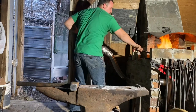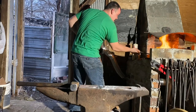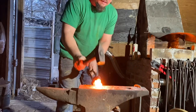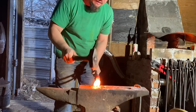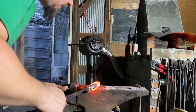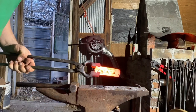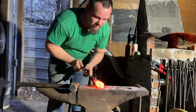We've got sparks — let that soak, then back off the air just a little bit. You'll notice I'm only hitting around the edges; we don't need to be collapsing that bore hole that we made. Okay, so we've got our tube welded. You can still see the seam there. Now we are going to octagon it at forge welding heats to make sure we have a really good forge weld on this thing.